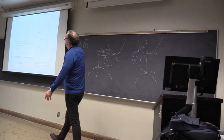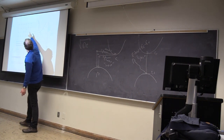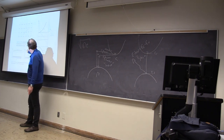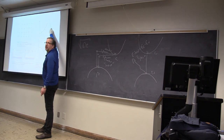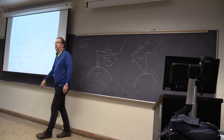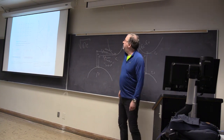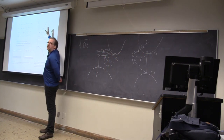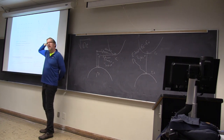And then if it's got that phosphorus dopant, the donor, it donates an electron right there. So the donor's energetically right there, donates an electron. And so then it's electron rich. And then I have my sail, right? This sail showing the representation of where the carriers are. And what's the boundary condition on the sail at the bottom? What's the rate limiting step, if you will, the boundary condition on the bottom?